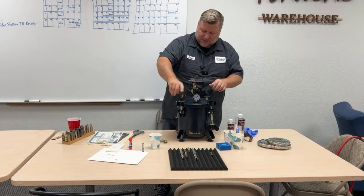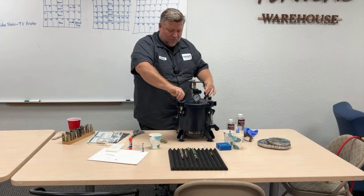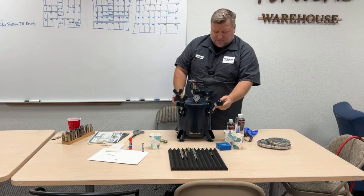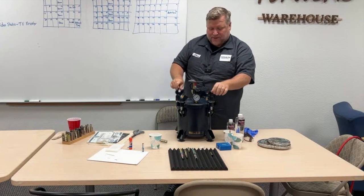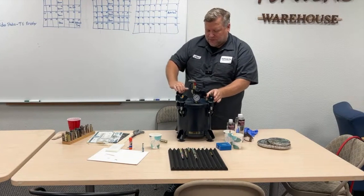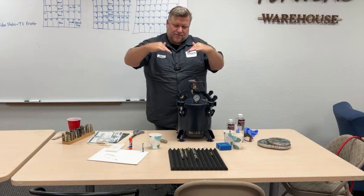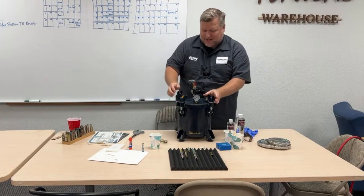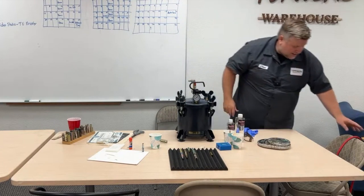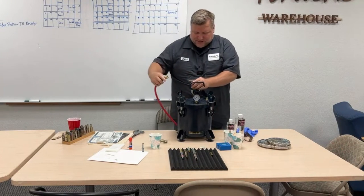Now, this is a great tip here, so highlight tip. When you're doing tube-in casting, and now this is my opinion, so somebody might disagree, I do not like to go over 40 pounds, because with anything with plugs or air in the tube, if you go over 40 pounds, you risk breaching that center and pushing your resin into the center of the tube. So 40 is my max. If I'm at 35, that's okay too, but I do try to get it close, but I do not go over 40. To me, I'm just asking for trouble for myself.